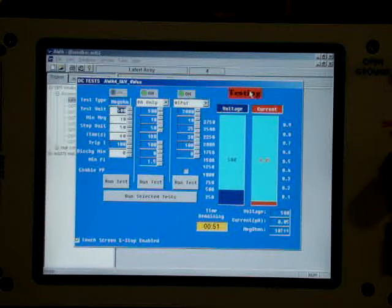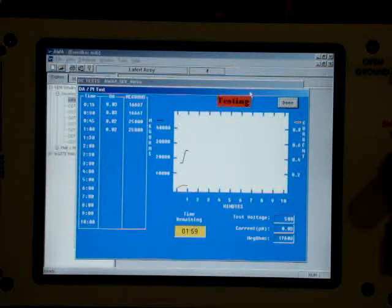Now we're already in the 11 gigaohm range. I should be showing up on the screen a little bit better than on our first set of tests on the fire pump, which a lot of these we just cut down because the time ran about 5 minutes over the 10-minute minimum. And this is our dielectric absorption, which is an additional 2 minutes.